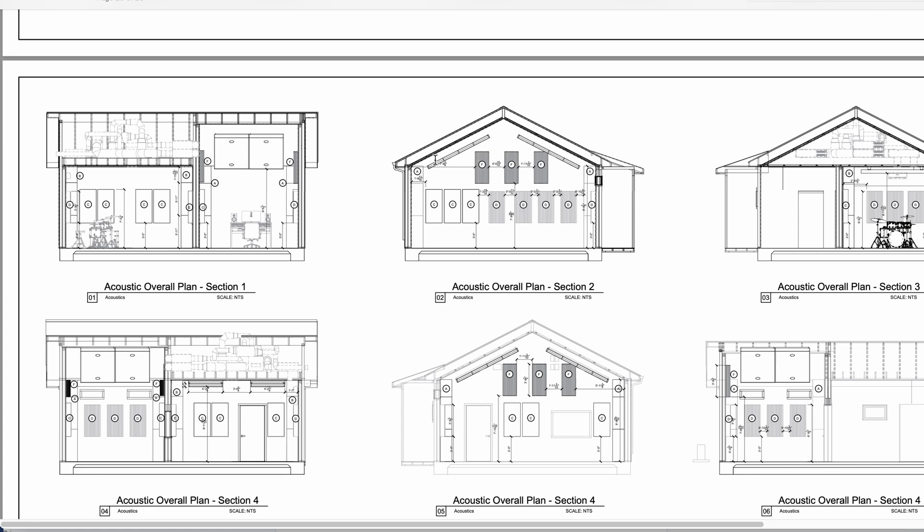For these rooms, we've got custom panels on the ceiling, which are going to be really helpful for our axial modes and reducing some of the low end because we can get them to hang down. In the listening position I really always want to get my direct reflections treated, and I always want to have bass traps in all four corners if I can, because those are some of the most effective ways to control reflections and absorption in your room. Then towards the back half of the room, I always like to do diffusion and absorption mixed together.